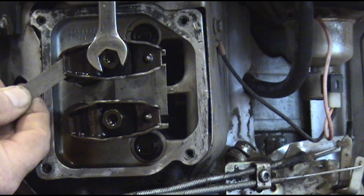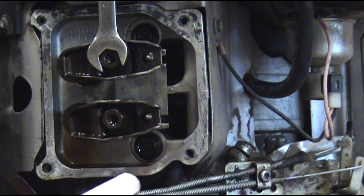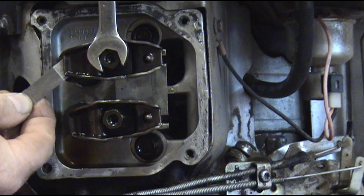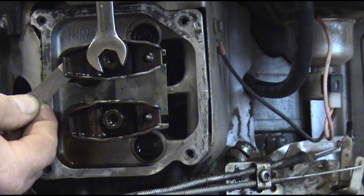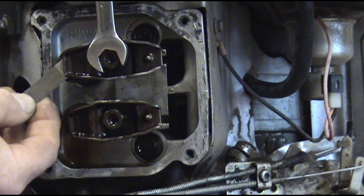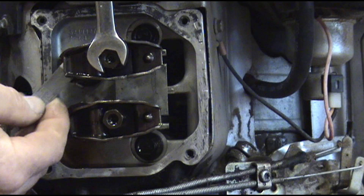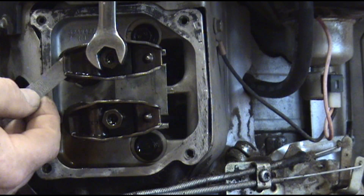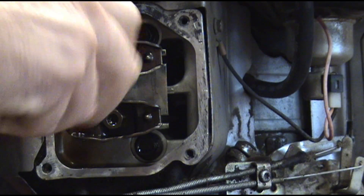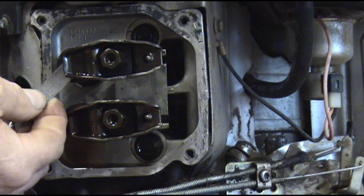I can get the four in now and it gets tight when it gets to the five. Remember, this is a four on the end and then it progresses to a six, so it starts out loose then it gets tight — that's what we're looking for on this one. But if you've just got a four, you just want to put it in until it's dragging a little bit, so it's kind of snug. We're going to stop right there. I'm going to lock the set screw down — right there, that's perfect, that's what we're looking for.